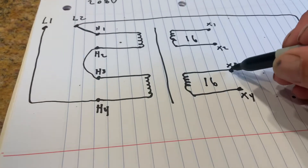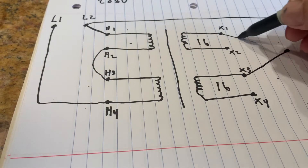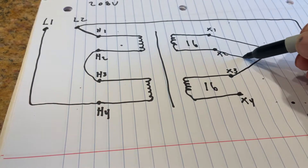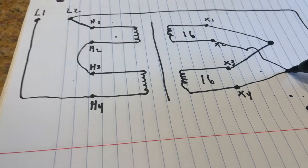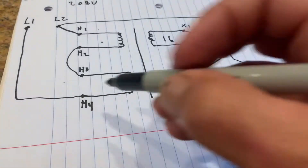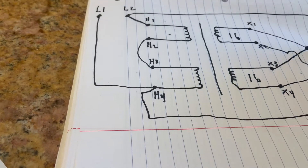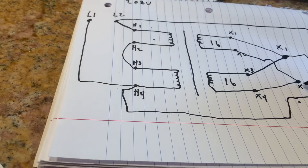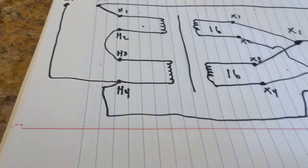So what we're going to do — let's set up this side. We're going to make a connection point here and connect them in parallel. This one has to jump over and we make another connection point. Now we have to feed the top of this, so we're going to come out of H4 and feed over here. This is really X1 right here — it's just a parallel X1 — and this is X4. Don't get confused with that, we just paralleled them.